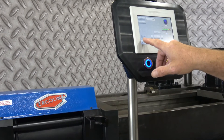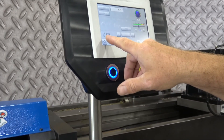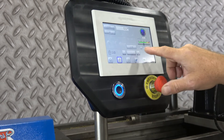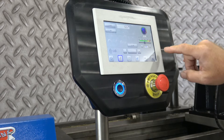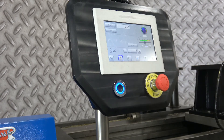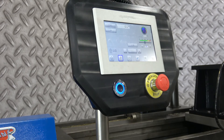This display shows what size hex you have in the machine. Currently we have a 110mm hex on arm due to the large tool. The limit switches are on. It also shows the load meter and the speed and what it is set at to manually jog the C axis. That'll be how fast the bend actually moves — so it's 45% in this case of 100.